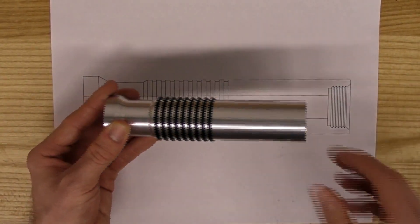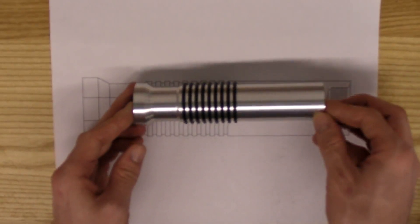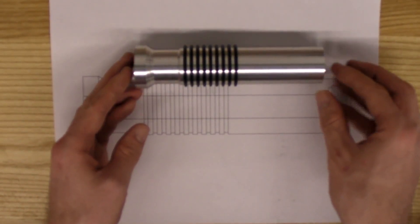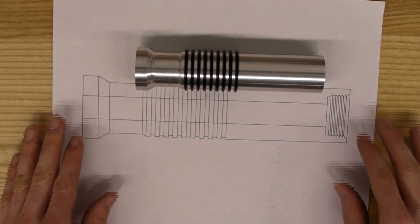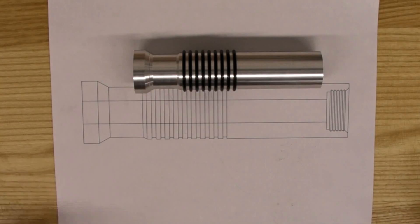The degree of this flexing is a function of the material used, how deep the cut is being made, and how long and thin the part is. For a short and thick part, like the top in the previous tutorial, this flexing is negligible, especially because the top was an aesthetic component and didn't need to conform to any tight tolerances. But on the lightsaber, because it's longer, the flexing can be on the order of a few mils.